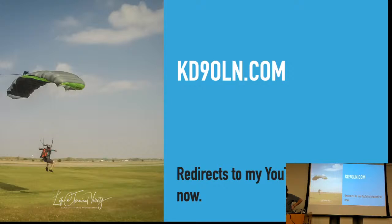Something else to put on your list to think about is going to UHF, because you can get essentially the equivalent gain with a much smaller dimension. And then you have to trade off the free space loss because of the difference in frequencies. But it's something to think about. So try UHF. Yeah, I'll add it to the list. I've already done 2 meters a bunch of times. May as well jump to 70.